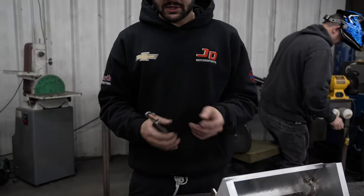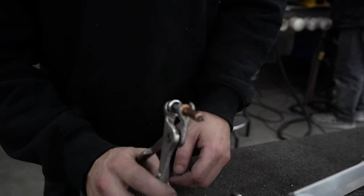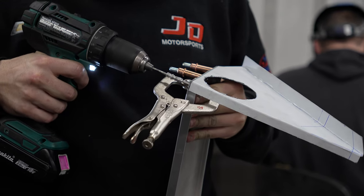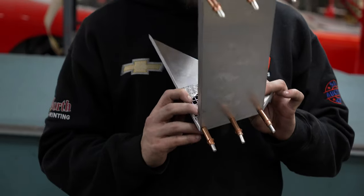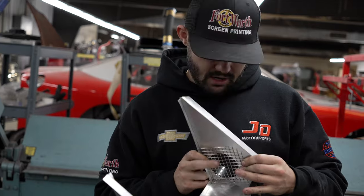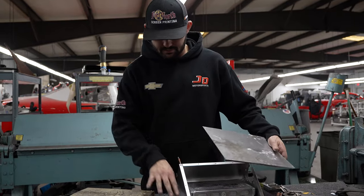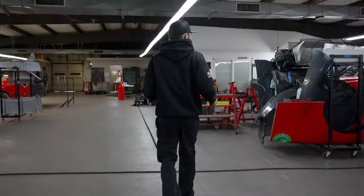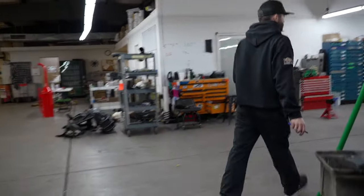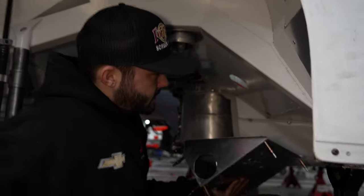Pretty much they go in, come back out. They go in narrow, come back and widen up. It's like a pop rivet but temporary. My pop rivet's in there for this duct — it'll hold the screen in there as well. The car already has enough welding in it, so I can just put holes in this and bolt it in the car. Basically how these things go on there, the reason this is a long flat bottom like this is to try to run parallel with the floor of the race car.